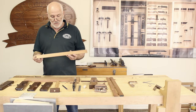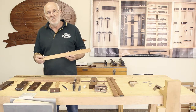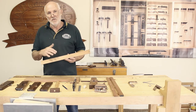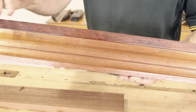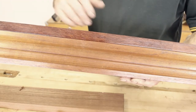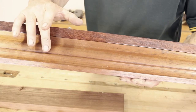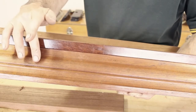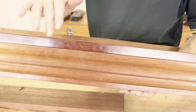The basis of that is joining two profiles together — one formed by a hollow and one formed by a round — and you must get them parallel and they must join together perfectly to form a certain shape. So you can see in this crown moulding we've got a cove here that was formed by a three-quarter inch round, and then we've got this more complex shape, what they call an OG, where you've got a round into a hollow. The basis of the moulding is to join those two perfectly together so that it forms a continuous curve.